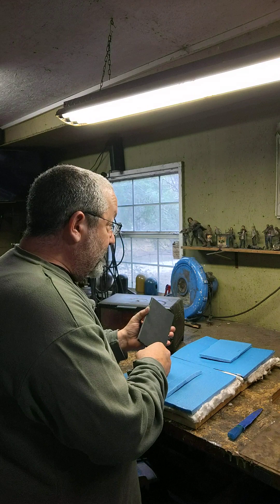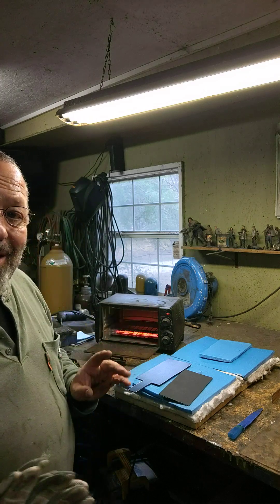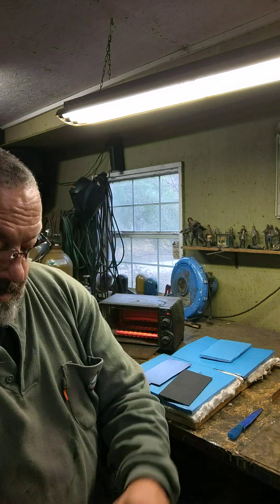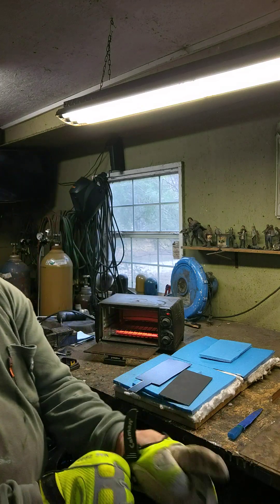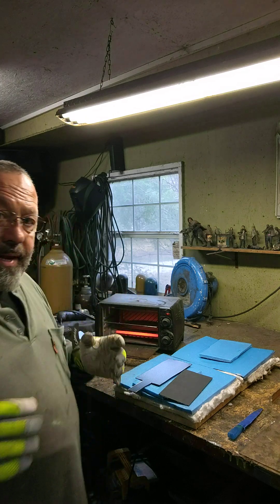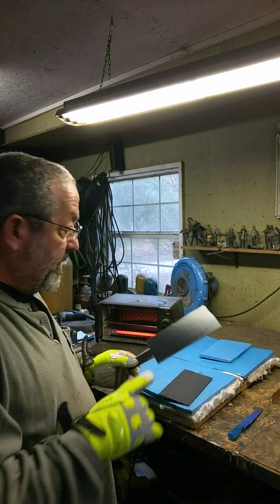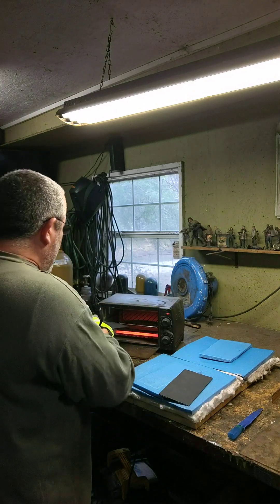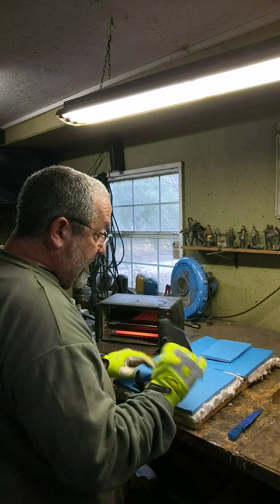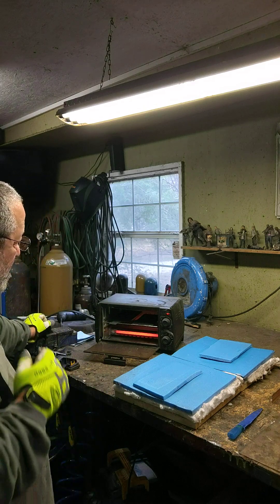Now this next part is tricky because both pieces have to get hot in the oven at the same time. And this stuff gets hot fast. You want to put gloves on because it gets too hot to touch with your bare hands. You've really got to watch this stuff because it will burn, it will bubble. So when I heat it, I put the inside of the Kydex — the smooth part — towards the heating of it. What that will do is if we do have a bubble, it shows up on the inside and you won't really see it. So I keep the door open when I do this so I can watch what the Kydex is doing.